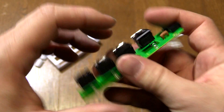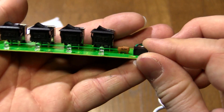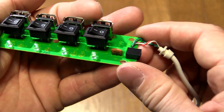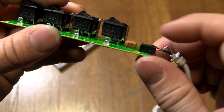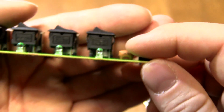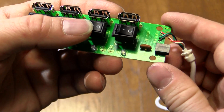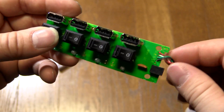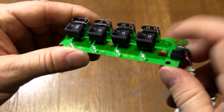This component here gives a clock signal to the chip, but it's not a crystal — it's actually a ceramic resonator. They're a lot cheaper, but not as accurate. A ceramic resonator is only about 0.5% accuracy to the rating; this one's at 6 MHz. Whereas a proper quartz crystal, like the metal oval can you usually see, will be accurate to about 0.001%. But for this application we probably don't need that accuracy — we're not doing any timing applications, it's just basic USB.